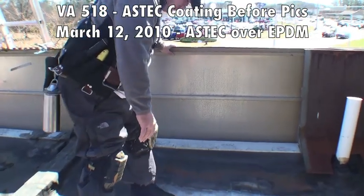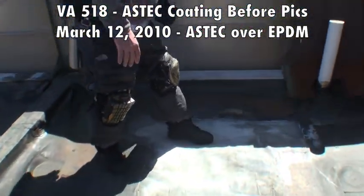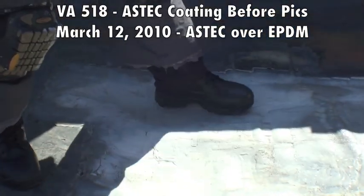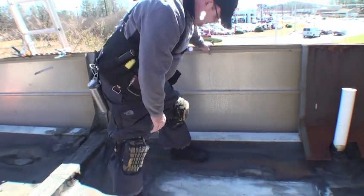First of all, there's no reinforcement here. We don't know what's going on, but there's no deck. So that's the first thing. The second thing is there's no cant strip. So you should have a cant strip here.